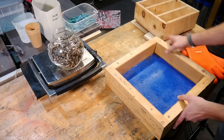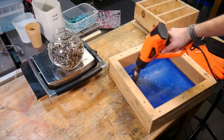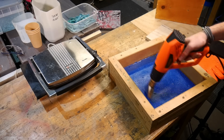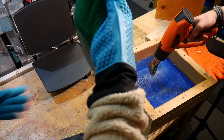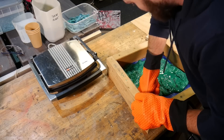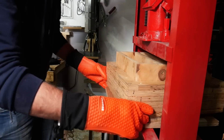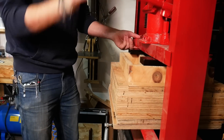When we took the blue sheet out of the mold we realized it had already hardened quite a bit, so we took a heat gun to it for about four to five minutes just so it was tacky — in order for the two sheets to bond together properly. If there's not a really good bond, there's a good chance the two sheets would separate once cooled. We then placed the hot green plastic on top, spread it out as much as possible, but had to work quickly because it cools down very fast. We then put the whole thing in our bottle jack press and left it to completely cool overnight.